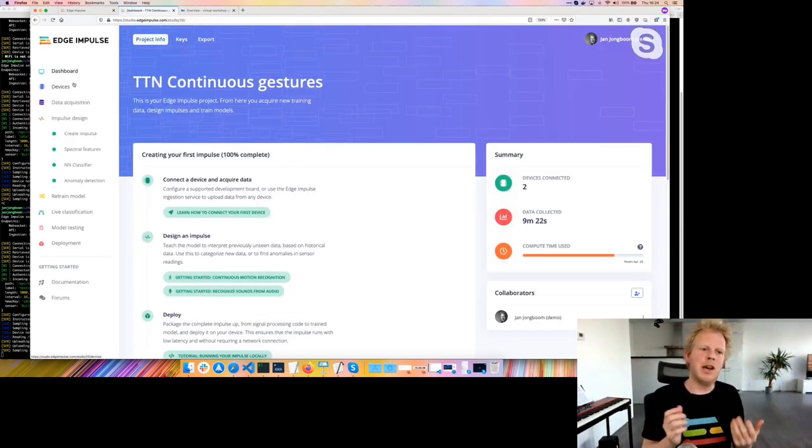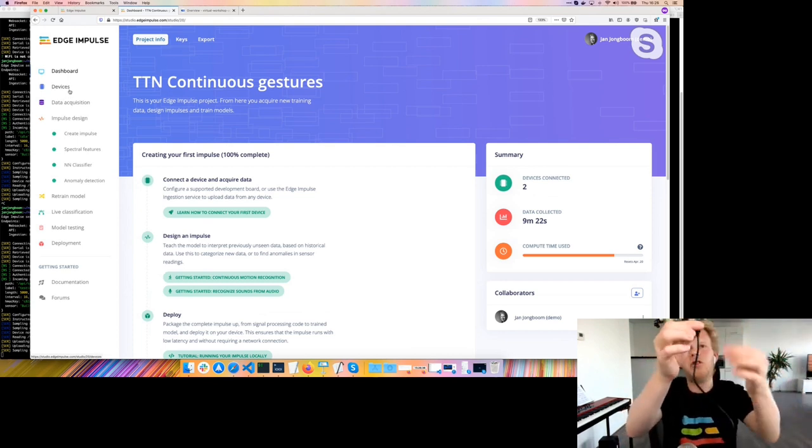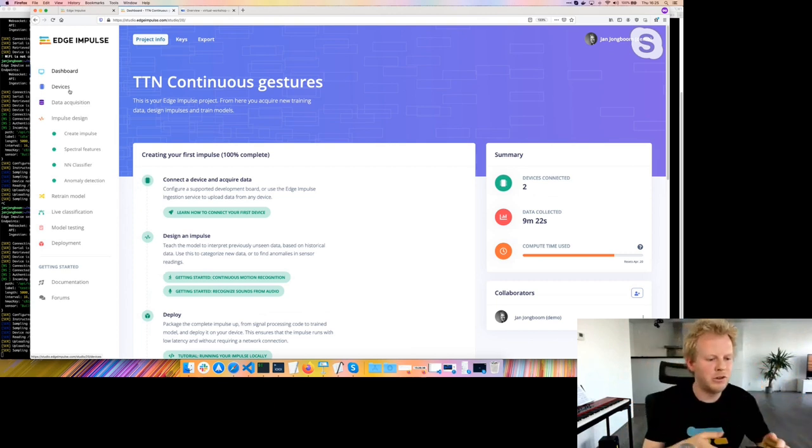As said earlier, getting the training data, the initial raw data, don't do it over LoRaWAN, because we need raw sensor data, and preferably minutes or hours worth of that data at a really high frequency. And you're going to be violating your duty cycle limitations quite quickly. So what I do here is I have just a serial connection to the board. The Disco board, fortunately, can also talk Wi-Fi, so we can get the data straight from Wi-Fi at that point.